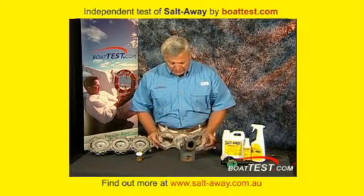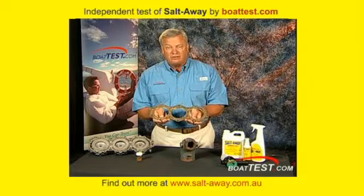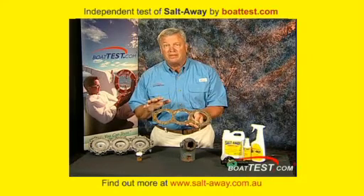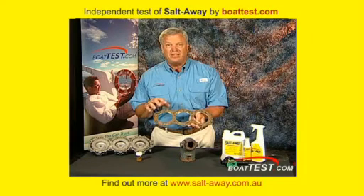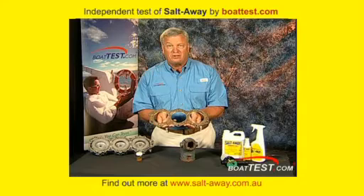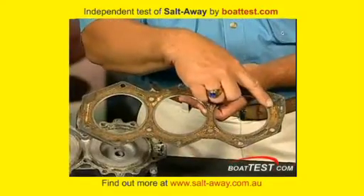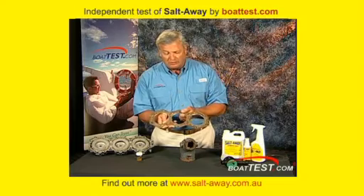What I've got here is an example of a head gasket from an engine. This gentleman was a marine mechanic, so he knew how to take care of his engine — doing meticulous care every time he went out. He rinsed the engine with fresh water so it didn't have saltwater sitting in there. But you can still see damage, because you can't rinse all the salt off. That salt begins to adhere to the surfaces, and as you can see here, it actually eroded away the gasket, and you can also see rust in here.